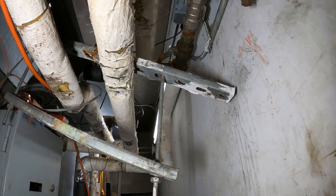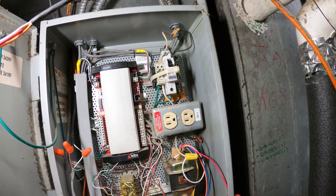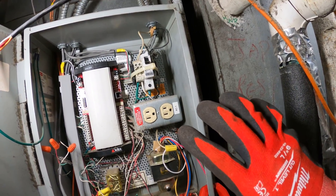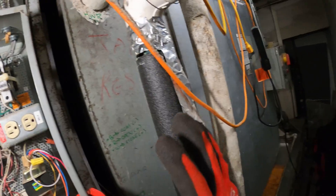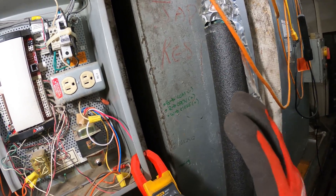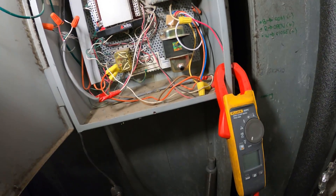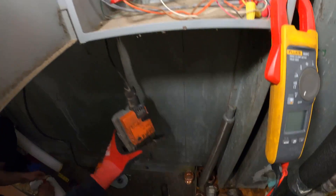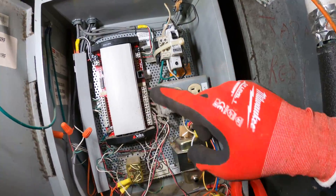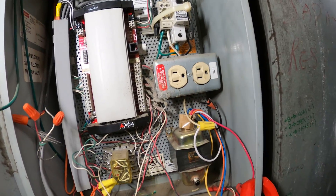From here, what I want to do is insulate the pipes and wire it. So here's the control panel. This is a BMS control system where this communicates with software where the engineer can control this unit and monitor it using his computer. For now we need to rewire the two new actuators. This was the cooling actuator, that was the heating one — they both come in over here. I just turned the power off. Let's go ahead and run the wires in and make the new connections. I'm just matching up the colors.